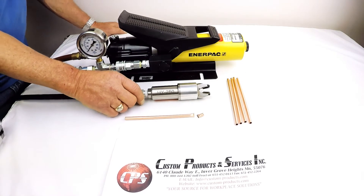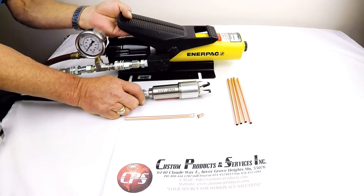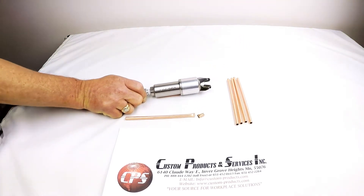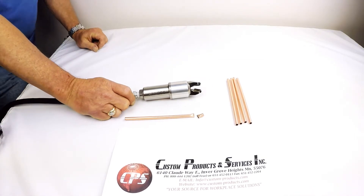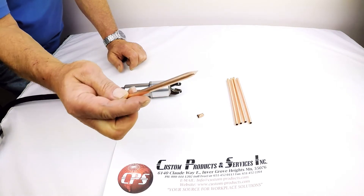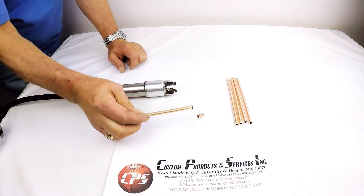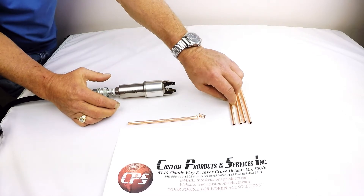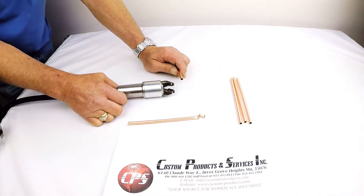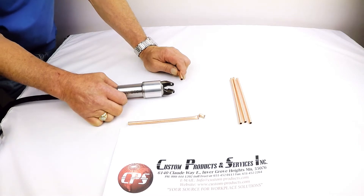This particular tool — I'm going to put the pump on the floor because it's easier to operate. This is what your cold welded joint should look like, nice and clean. I'm going to do a pinch-off here so you can see what a normal pinch-off looks like. The tube separation should take place within two to three seconds.